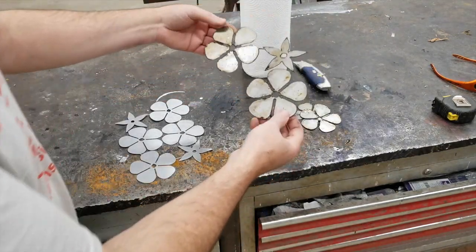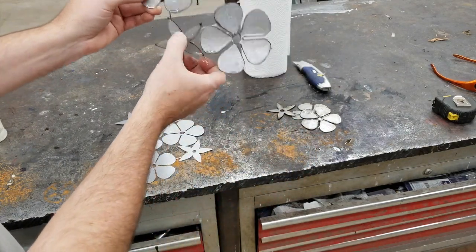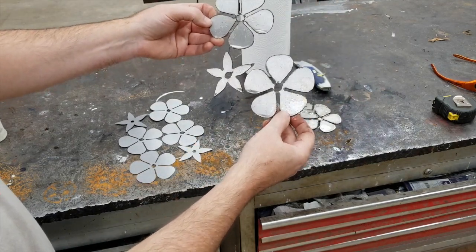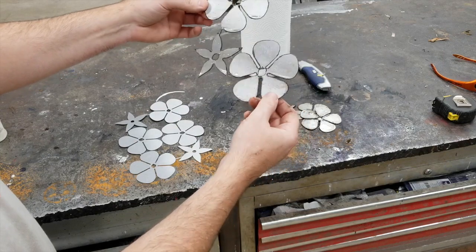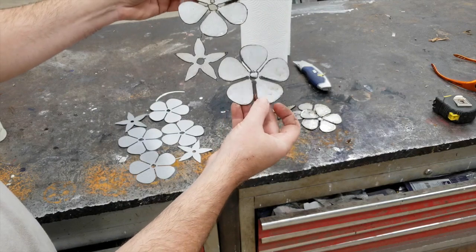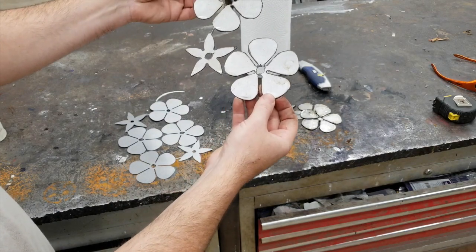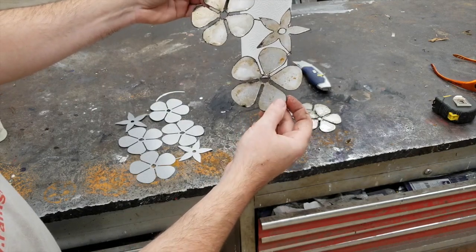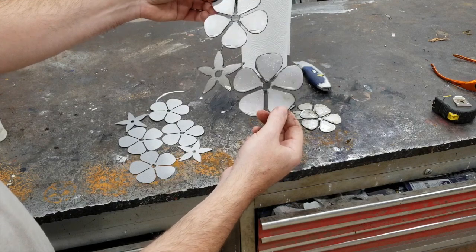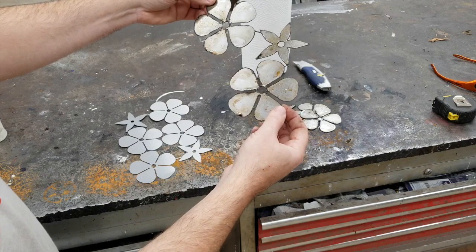So this is the plasma. You can see in a few areas it almost nipped the bridge away, and then in other areas it completely blew it away. I can't remember exactly what the bridge width was on it. That's the back of it, and you can see it really doesn't make any sense to pre-grain your cold rolled or anything on a plasma, because you have a lot of cleanup work to do — lots of dross.